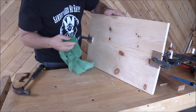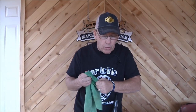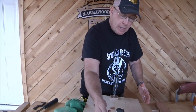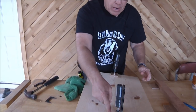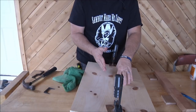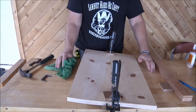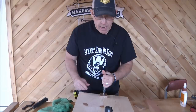These pinch dogs are really cool. I could definitely see — if you think about it, it's like 20 bucks for a pack of 10, or 18 to 20 dollars, which gives you a lot of clamping. Now if you've got a super long board, go watch Paul Sellers' video — where if you had a little bit of a camber, meaning a gap here and a gap here, it would have a little bit of a spring joint, and that's where you wouldn't necessarily need that. With this, or if you've got a little bit of a cove cut, you would definitely need a big bar clamp in the middle or find another way to clamp it. But this is going to be plenty good for me.